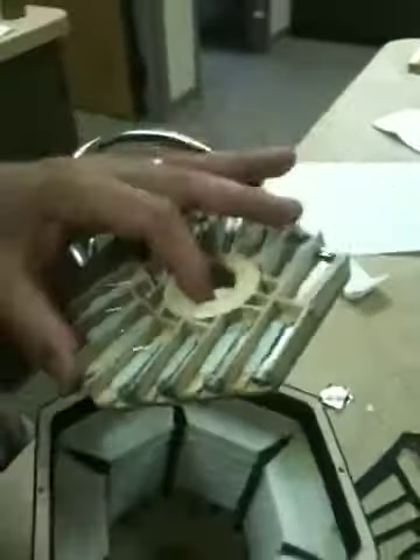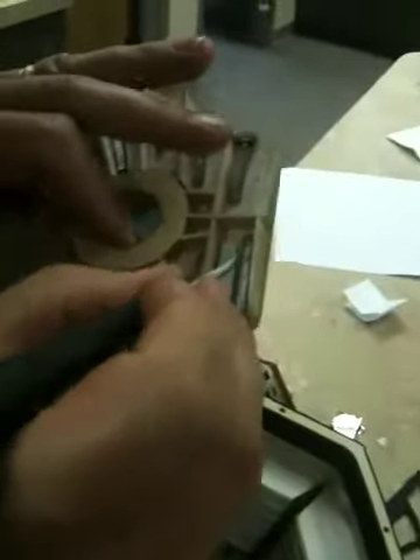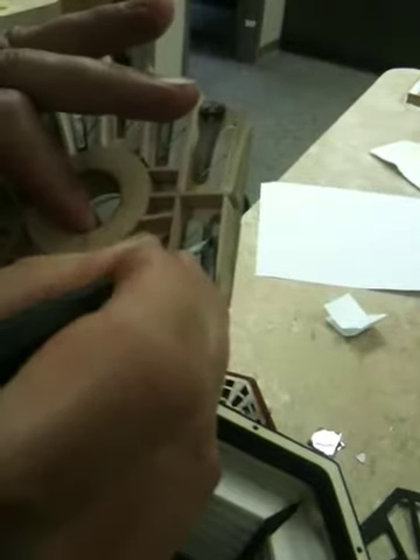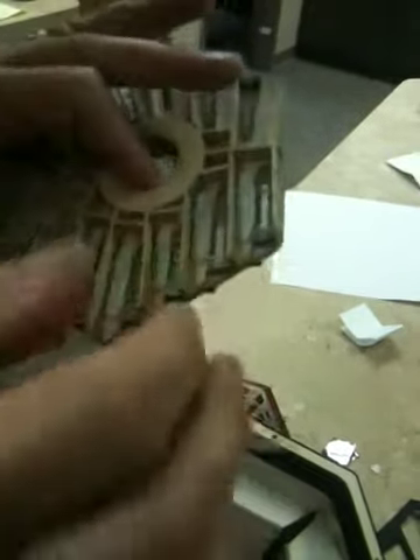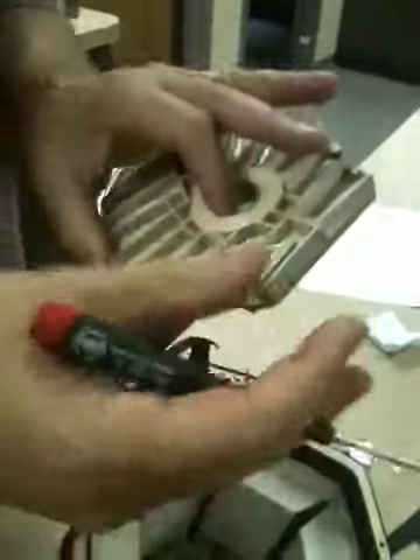There are different ways you can fix this. The easiest way is just to take the screwdriver — if you can tell which side it's pressing on, you could just gently press it with the screwdriver until it was clear and free. You just barely press on it and try it until it finally frees up. The first thing you should do is pull it out and push it back in and see if the problem has gone away, because sometimes the wood can swell and it pinches the frame into the tongue.